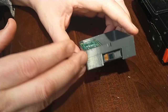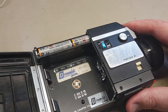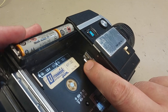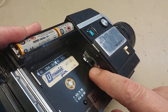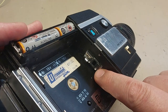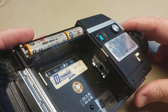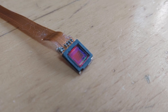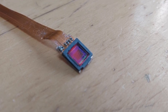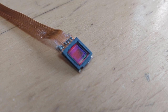If you watched the previous episode you'll have seen that I had a cartridge with the sensor from a Raspberry Pi camera mounted up against the metal film gate side of the Super 8 camera. I could never get this to work properly, I could never get it into focus and I now understand why. The film in a real Super 8 cartridge goes right up against this metal plate here, and I could never get that into the same focal plane because the sensor for the Raspberry Pi camera is like a little glass box with the sensor being a silicon chip at the back of it, so the light always has to pass through about a millimeter of glass.